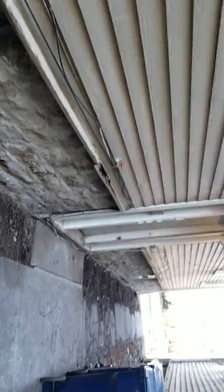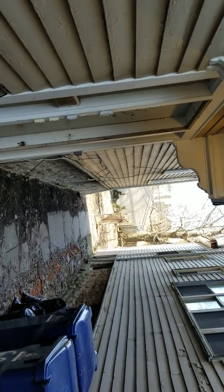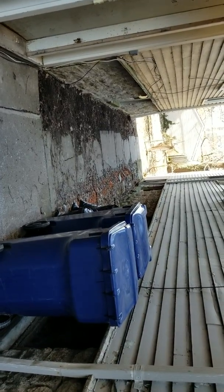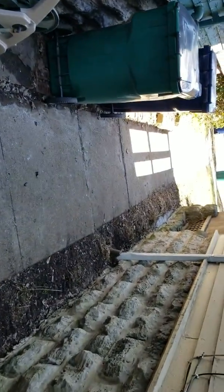This house we're looking at is going to need some siding work, and a lot of that damage is due to rainwater overflow, so it's causing a lot of the deterioration. We're seven feet from the ground to the bottom of the curve there. Wherever our boom is, I believe I can get in at some configuration, but I don't know what my range will be. We've got to be able to get up at least 40 feet, and if we can't reach out a little bit, it's not going to work.